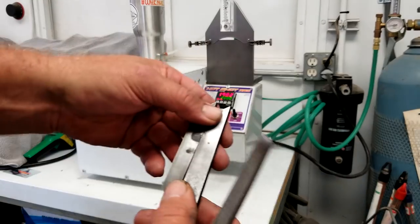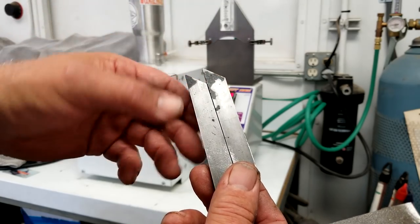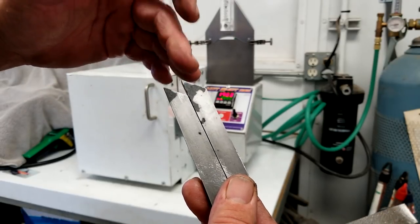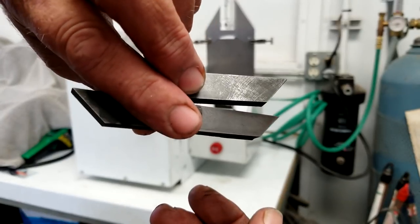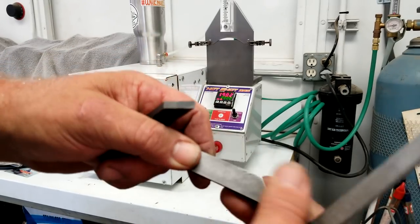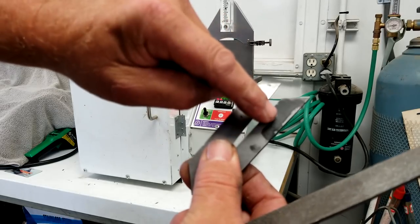The parts are out of the oil. All I've done is take them to the sink, spray them with Purple Power, and wipe them down with red scotch-brite — most of the scale just knocked right off. Out here in the front is pretty interesting — this is where it was facing the door, so the oxygen flooded in and hit these first. The backs are really clean. We made hardness, no problem. It's interesting that just the two tips toward the door are where it scaled up.